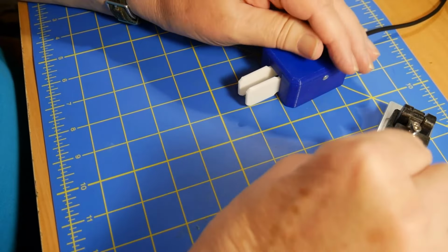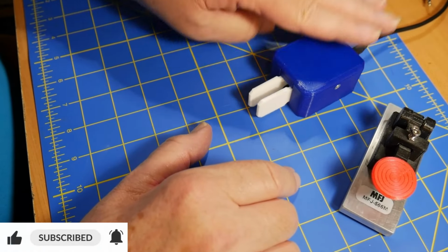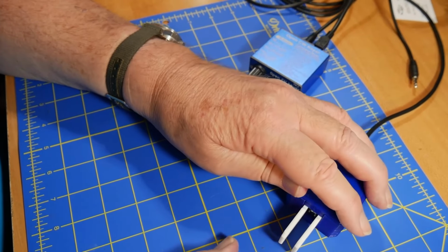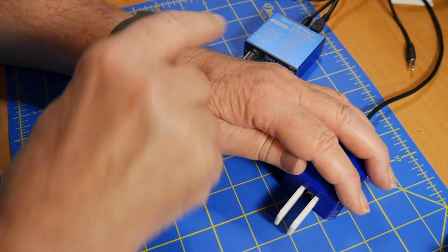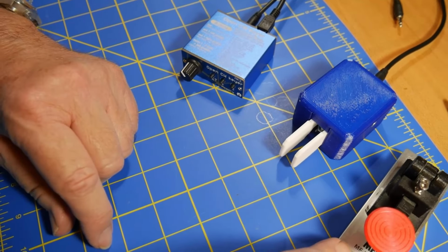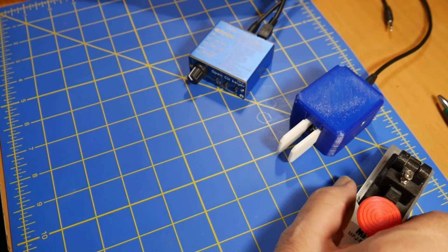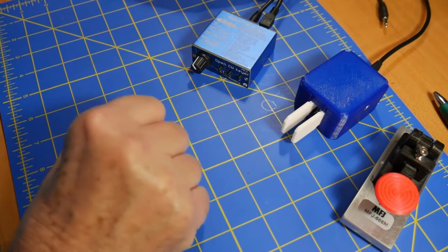Notice also that there's no up and down motion. It's just side to side. And you can let this thing slide all you want, although I'd kind of keep a hand on that or mount it to some sort of a base. Now, once you get good enough with it, you're going to want to get your speed up to about 15 words a minute and get your code receiving skills up to about 15 words per minute before you put this on the air. Now, one thing this does is it completely destroys the operator's so-called fist. With a key like this, you are shaping both the dots and the dashes. When I'm doing handset Morse code, I tend to send the dahs quite a bit longer than the dits rather than just three times. This forces you to send perfect code.